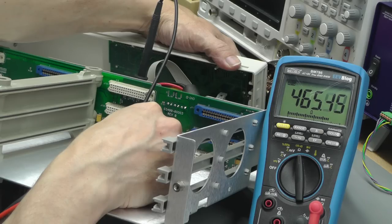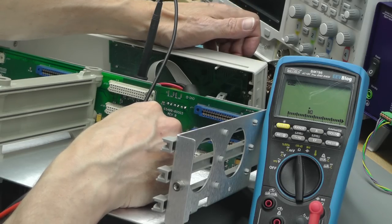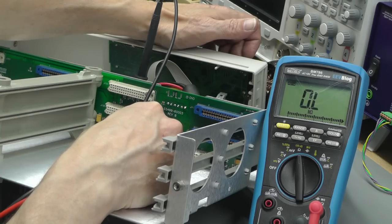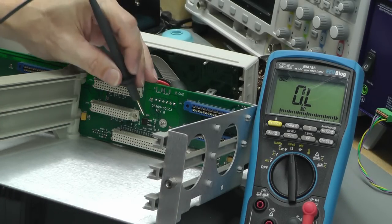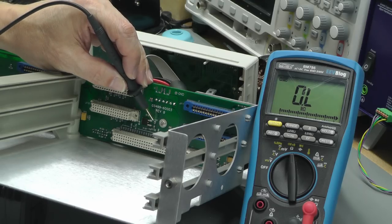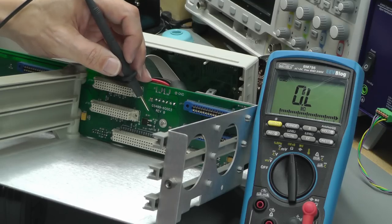we get about 470 ohms there, and I'll push it in again, latch it in, and it's grounded, 0 volts. So the switch is okay all the way back, all the way into R102, which goes on to the gate of that P-type FET. Okay, I just got thrown there for a second off camera. There's a couple of resistors, as I mentioned, and R103 here and R101 down there are labelled wrongly on the schematic, so that kind of threw me for a second.